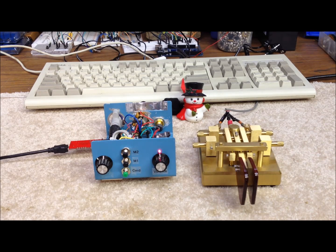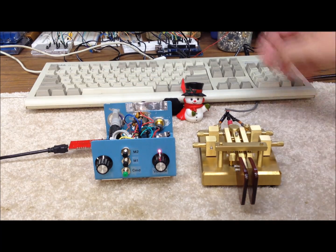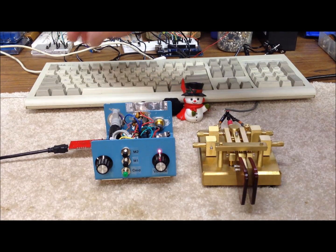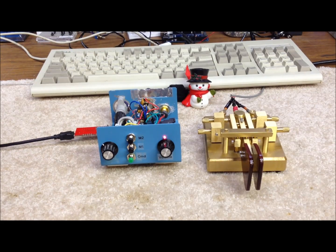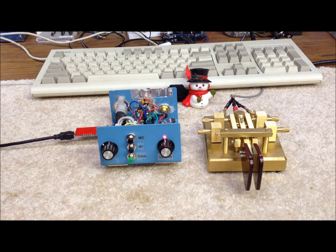Pretty much everything we do we do from the PS2 keyboard. We have programmed the F keys — we've got 12 of them. F1 is our call sign, then there's QRL (are you busy?), and a CQ programmed in. You can stop anytime by hitting the escape key. You can also send code directly from the keyboard and it'll go just as fast as you can type. There's also a built-in buffer so you can type way ahead if you want to. You can change all the functional parameters of the keyer from the keyboard itself, the key paddle itself, and there's also a command line interface to change all parameters and monitor functionality from an attached laptop.